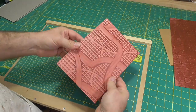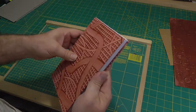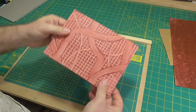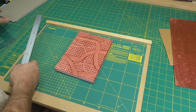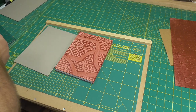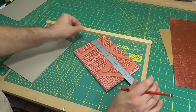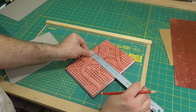Today I'd like to demonstrate a way of covering boards that almost eliminates the chances of them warping. Boards warp because when the covering materials are glued out, the material absorbs moisture from the adhesive and stretches. It gets larger, it's applied to the boards, and when the material dries, it shrinks again and it pulls on the board, causing the boards to warp.